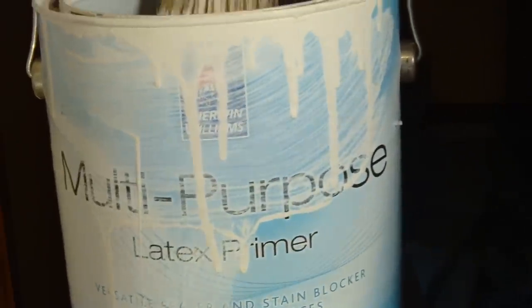It doesn't take very long to have a surface that's ready to be painted. Then just use a good quality latex primer, let it dry, sand it a little bit if you need to, and then topcoat with whatever you prefer. We're using an Alkyd water-based paint on this project.